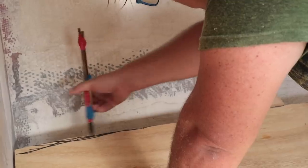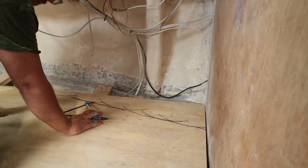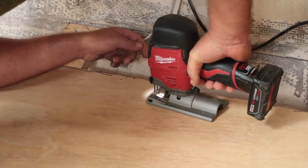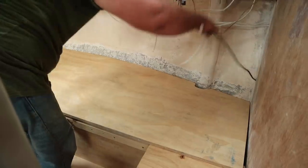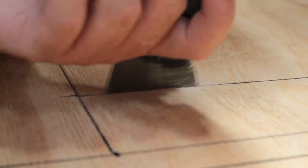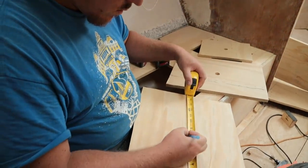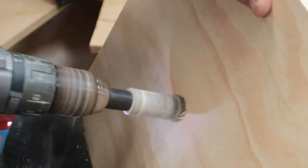The primitive compass came in handy for getting all those odd angles. The odd angles of the sailboat interior required us to leave some extra centimeters for shaving and snipping when fitting the final pieces. We made the initial cut for the storage bins with the multi-tool and opened them up afterward with the jigsaw. Again, we wanted to avoid stainless steel hinges, latches, and things of that sort, being in an isolated part of the world where marine hardware is not easy to find.